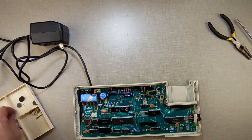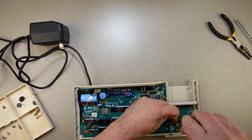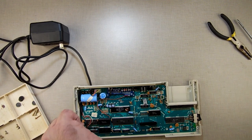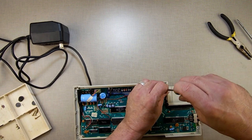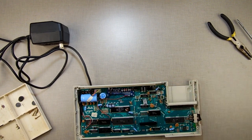And as I've said many times before, what I do when I put the screws in, I take the screw, put it in the hole, unscrew it until it clicks, and then screw it in. That way you're lining up with the original thread holes that were there. Now, let's just see. We have one here. One there. No, not one there. That's through the outside. One there. This one.